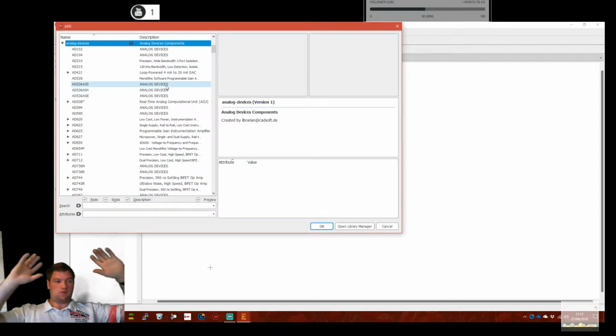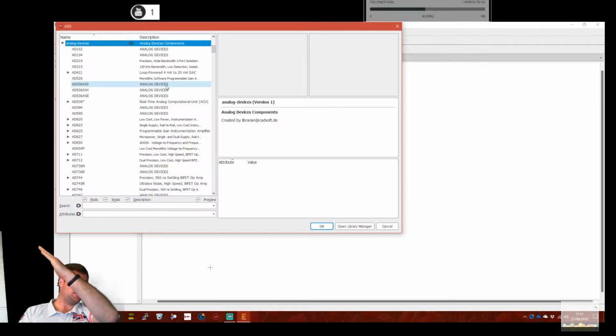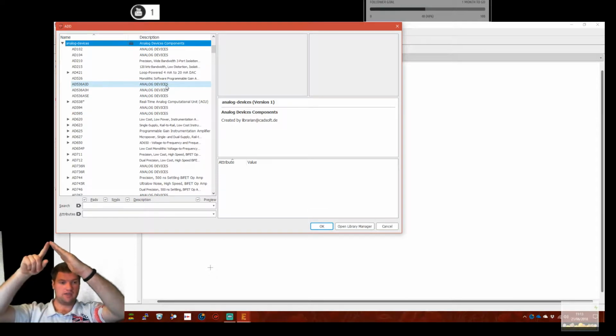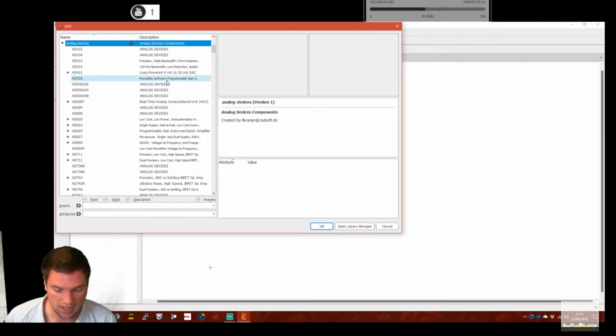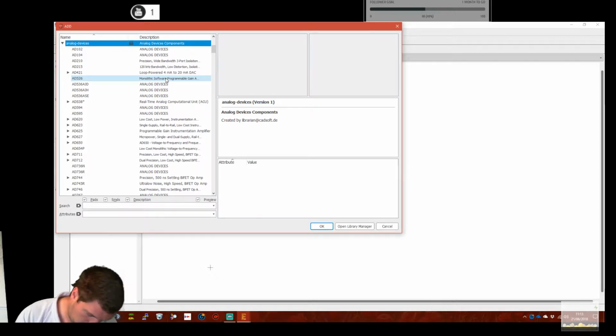So, wide voltage range. That's pretty much a linear discharge curve. So if you've got voltage here and you've got time along here, assuming you're pulling a constant current, the voltage will drop reasonably linearly. Supercaps, that's not strictly true, but it's certainly a lot more linear than a lithium-ion battery,